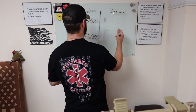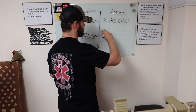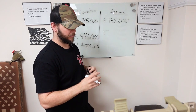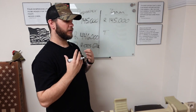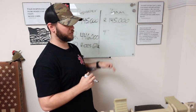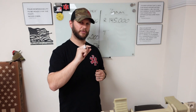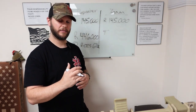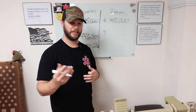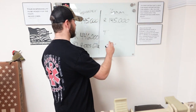Alright, so receive is going to be 145.000. That's going to be all you've got to put there. Now we're going to start working in the menu. So keep in mind that you could do the dual monitoring and set this up on one and set the transmit up on another. You could do that, but there's a lot slicker way to do this where you're only using one line on the radio, and that way if you had to reserve the other line, if you needed to switch lines for, say, a contingency plan or something like that, you still have that other line open. So I like to do it like this.